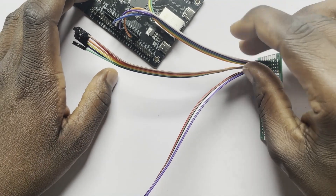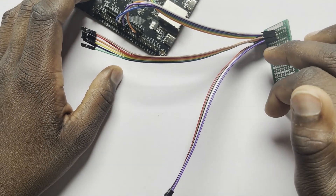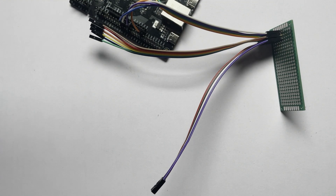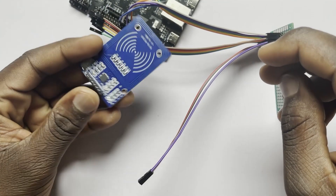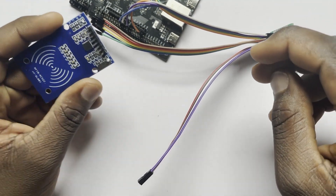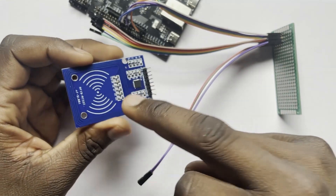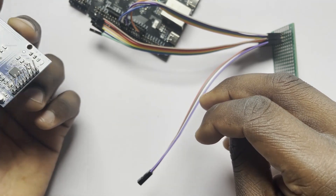Now that all the pins are connected, the first layer of pins goes to the microcontroller and it will power each successive layer of pins. We can now connect our two antennas, and we will simply reserve one pin per antenna — the slave select pin — that will be the only unique pin per antenna. The reason this works is that the slave select pin only needs to be driven high or low for the antenna to activate, so any GPIO pin can work. Just make sure to configure it in push-pull mode.